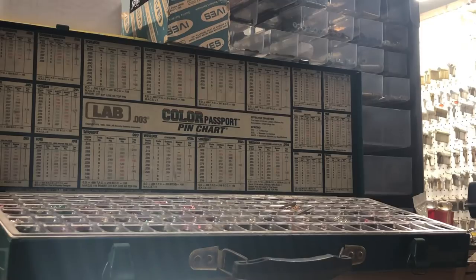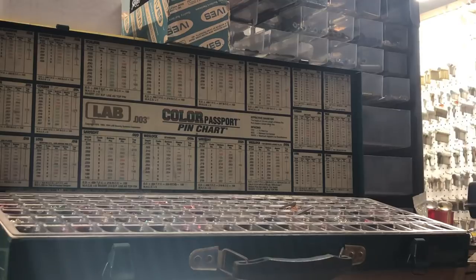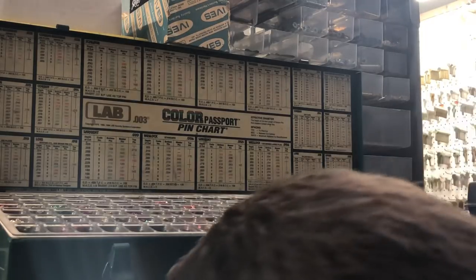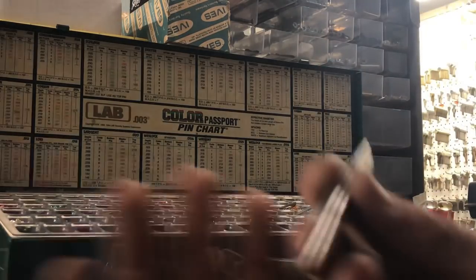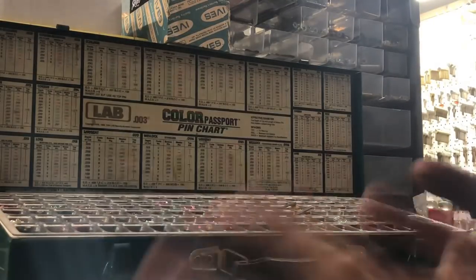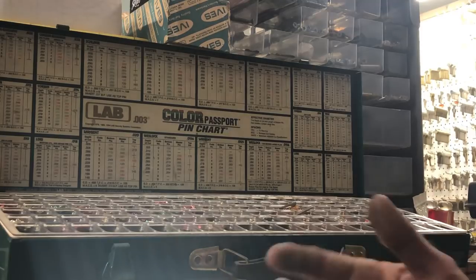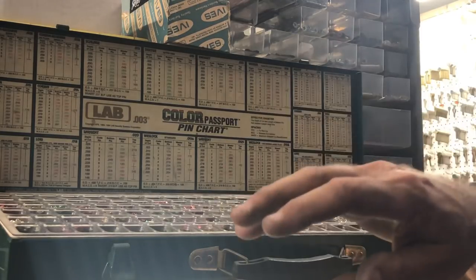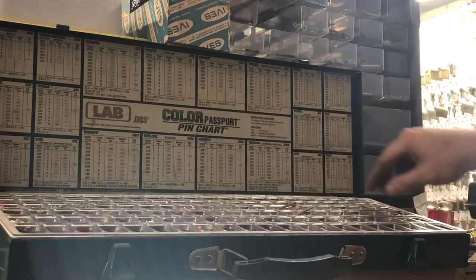However, if you have a Kwikset original kit, that's even better. Sorta. No, it's not. You can use an original Kwikset kit. However, I kind of thought better of that while I was talking, because the Kwikset original pins are rounded on the top and bottom, that gives us a lot more slop in the cut of the key. So with those rounded pins, I'm trying to check accuracy, so I really do want to use a 03 kit because that's the most accurate.